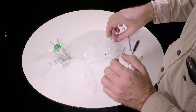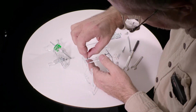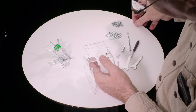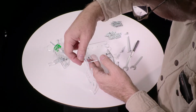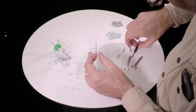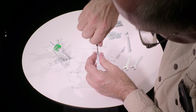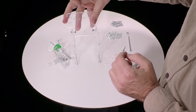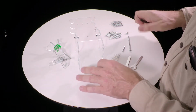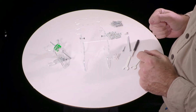And we do the same thing with one nut in here and a short screw. As soon as you have the screw pressed in there, it becomes much less delicate, less likely to fall out. So we can tighten that. Okay, now we have something that will stand up. And from here we're going to basically assemble the interior of the transmission in place here.